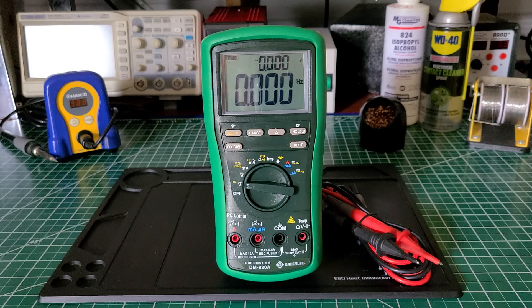When you buy this meter, what comes with it: you get a carrying case, test leads, a temperature probe, and a nine-volt battery. The leads you see on the side here are not the leads that come with it — I always change out my leads to fusible test probes. These are fusible test probes sold by the company called Reed — R-E-E-D — Instruments. They have five-amp fuses inside of them. I use those with basically all my test instruments for safety.